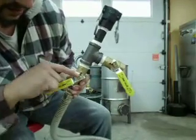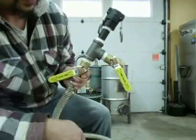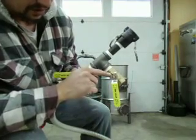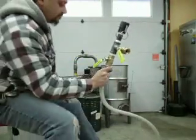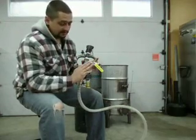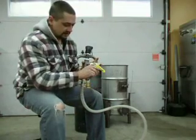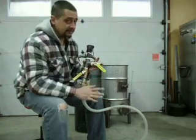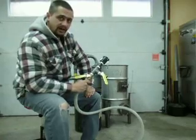Come up close — I've got little Sharpie marks that correspond to where my gasifier and generator like to run. Those marks tell me where I need to set the gas and where I need to set the oxygen. The oxygen is very, very picky — we're talking maybe an eighth of an inch either way and it runs horribly.